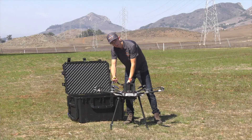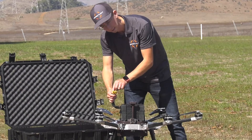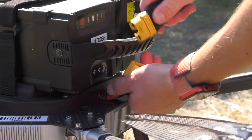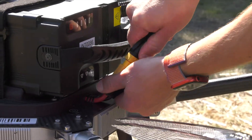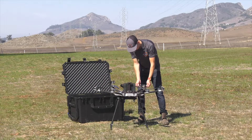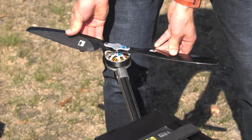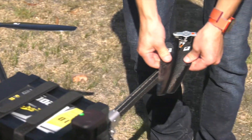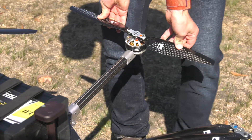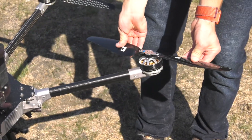Plug in the battery lead into the lead in the back of the aircraft. You'll notice that the battery connector has keys, so it can only go in one way. Now we'll unfold all of the propellers. It's important to do this because although the spinning motor can unfold the propeller on its own, it puts undue stress on the motors, and if only half of the propellers are unfolded, the thrust on one side can flip the vehicle.